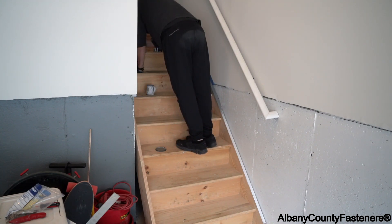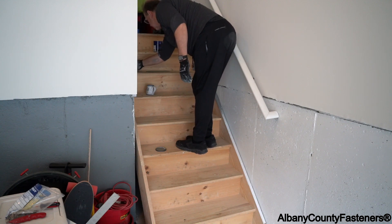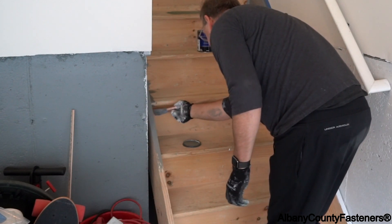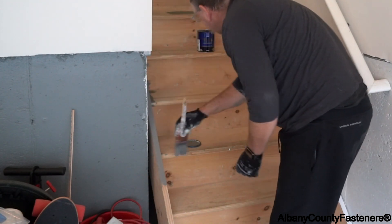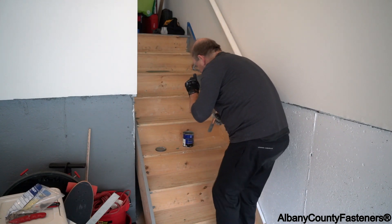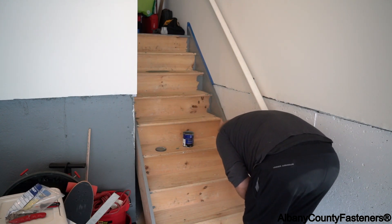The paint I selected for the stairs is the same gray that's on the walls, so anywhere it comes in contact with the walls it's going to look the same. This is an eggshell finish — it has a slight sheen to it, not a high sheen. I didn't want a high sheen on the stairs. When working with paint, after you dip the brush, always start at the high point and work your way down to the low. I didn't mask this section of the wall because it's already painted gray, not white, so I'm not worried about gray paint getting on there.